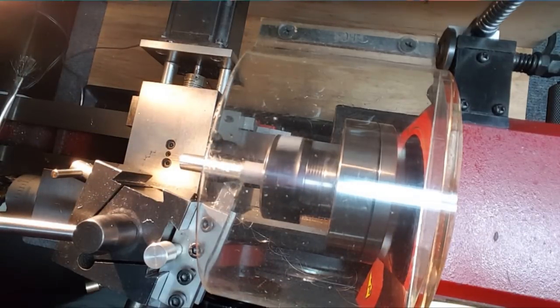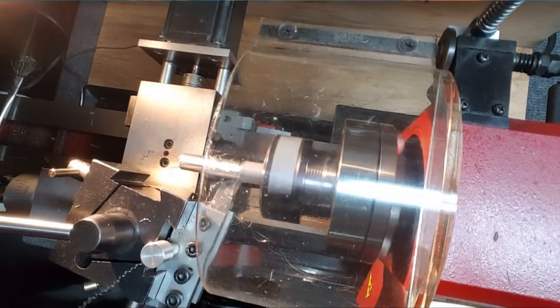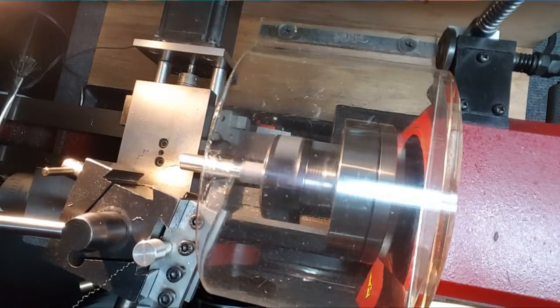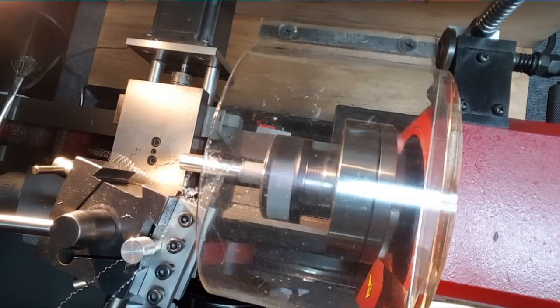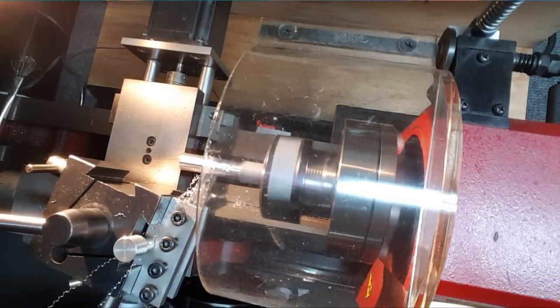And reverse direction. Take it off external. Go in 5 thousandths and go. Yeah, these chips are sharp. You gotta be very careful handling these guys. Oh, it's all wrapped up in my mic cord now. Great. And my feet, but so it's just a matter of taking this down to a 1/4 inch.